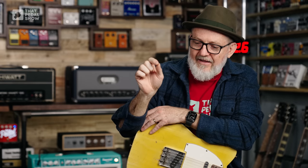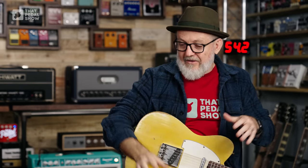Nice. So Metal Zone is really interesting for a couple of reasons. The design of it is actually genius. When your signal goes in, before it goes through the gain stage, it has this mid hump. Then after the gain stage, the bass and treble are added in, and then EQ is after that. So the semi-parametric mid is post everything, is it? Well, the EQ and the parametric is post everything. Right. But you have this mid hump that goes into the gain stage. After the gain stage, they add all this bottom and top back in, and then after that is the EQ. Any idea what the mid hump is? The frequency. I didn't know. We'll research that and put it on the screen here.